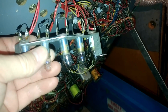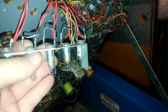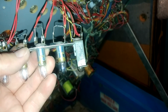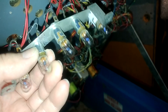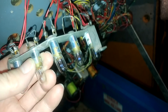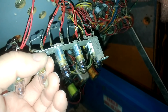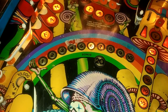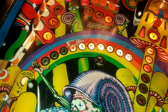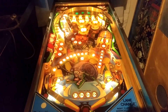I'll get those replaced — that's pretty good, mostly working lamps. I've taken out the lamp holder to look at numbers two and four. Number two spins very freely so it's not making good contact. I've filed the surface to clean it up and I'm going to put a big blob of solder on there to join the two pieces together. That brightens it up — you can see all the numbers working fine now.